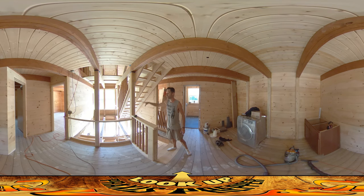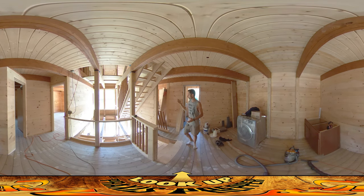There's going to be a set of lights in this large vertical area, and the reason for that is I wanted you to be able to turn on the lights at any point and turn them off at any point. If you didn't do it as a six-way, you'd have to turn on lights before you go up the stairs at night, then turn off that set, go to the other stairs, turn on another set, and turn them off when you get to the top. With a six-way you get five switches, and if you flick any of them they're going to actuate the lights connected to them. So you could turn on a switch at the bottom, go all the way up, and turn off the lights when you get to the top. One set of lights controlled by five switches.